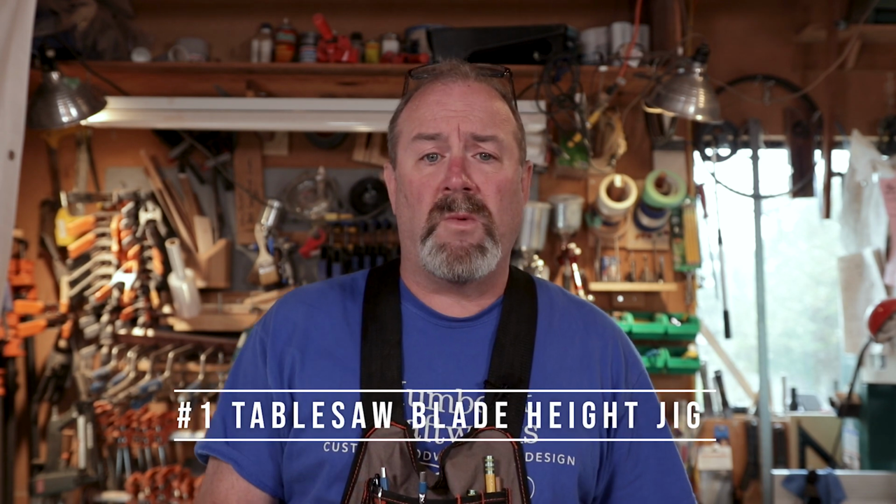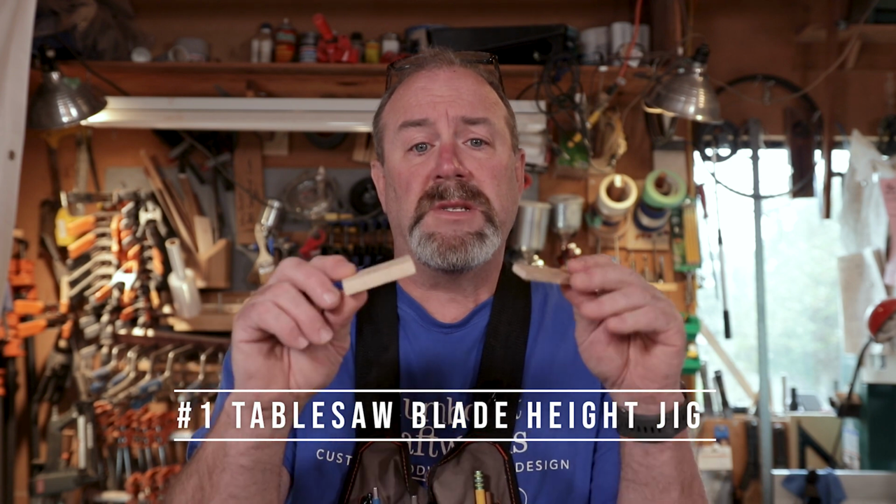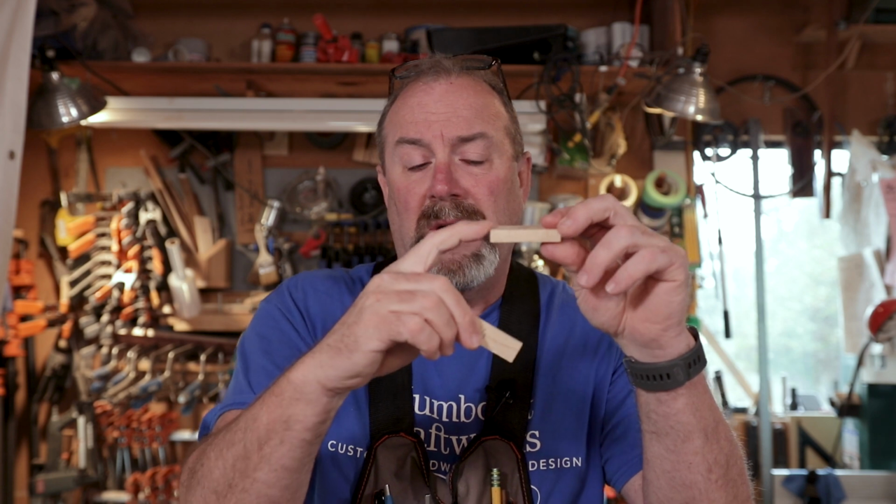Okay. Next. So number 1, which isn't number 1, but it's just number 1. The first thing I do is I use these sometimes to set up my table saw. 1/4 inch I use quite a bit, so for a lot of things, dados or whatever you're doing on the table saw, I use 1/4 inch and 3/8 quite a bit to set the height.